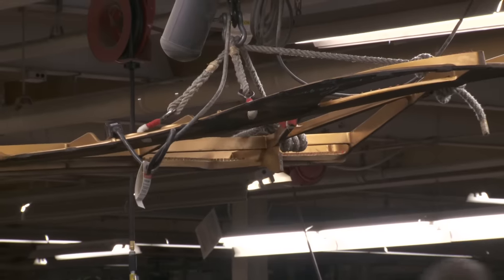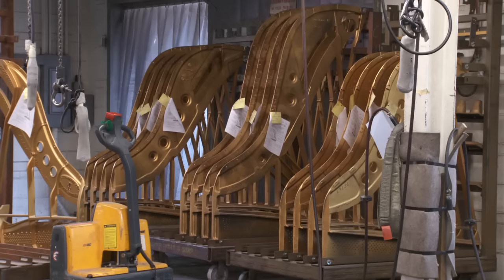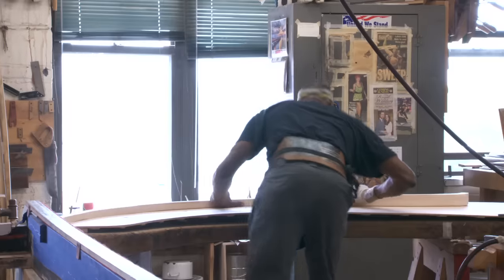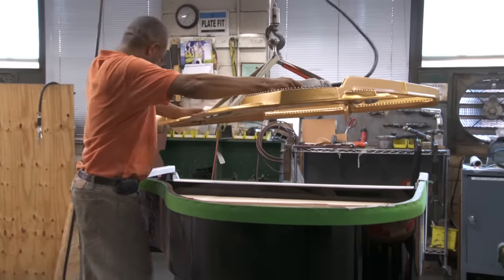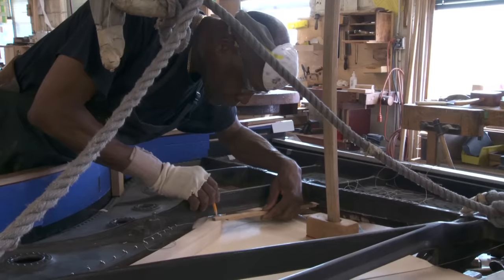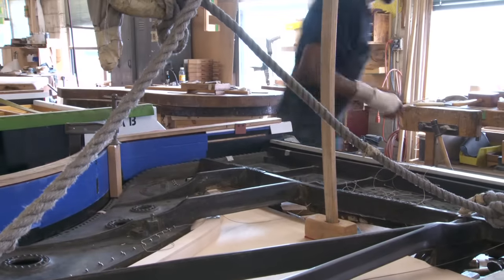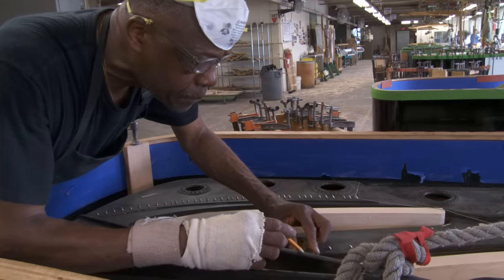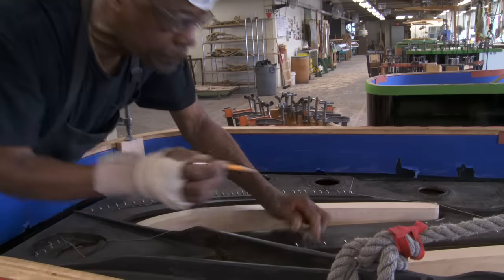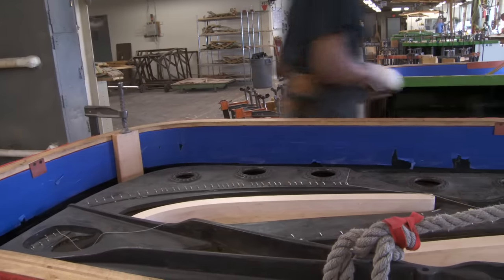One important component is the iron plate, cast from bell-quality iron in one piece from our exclusive patterns. The soundboard, with its bridge and cast iron frame, are now assembled inside the piano rim — or the belly of the piano — by a man called the Belly Man. It is an involved process to get the soundboard correctly placed and the bridge height precisely determined, so that the pure Swedish steel strings we use will have the correct downward pressure, or bearing, on the bridge, all across the scale.